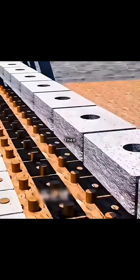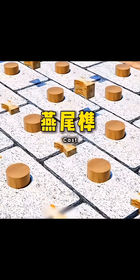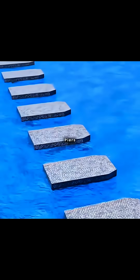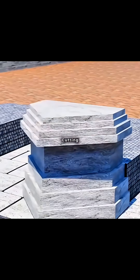Ingeniously, you drive tree roots and wooden piles into the riverbed, then build granite piers on top. You connect the stone blocks using dovetail tenons cast from pig iron, forming a solid underwater backbone. However, the turbulent river currents cause the piers to shift, so you design the upstream face of the piers with a sharp angle, cutting through the rapid flow like a blade, while the downstream face is built square to withstand water pressure.